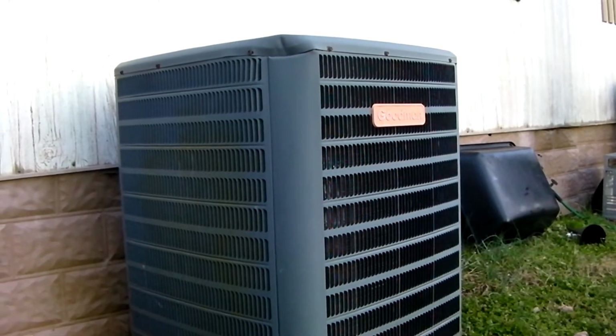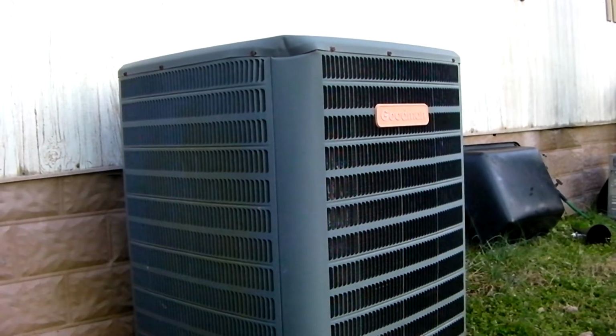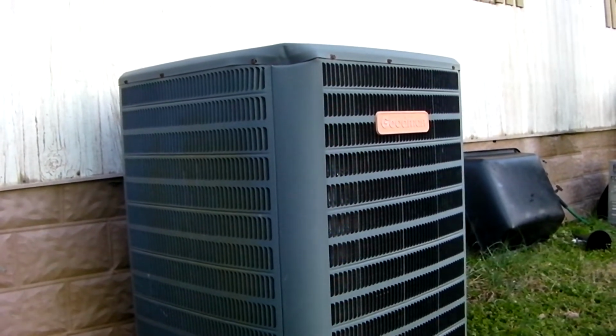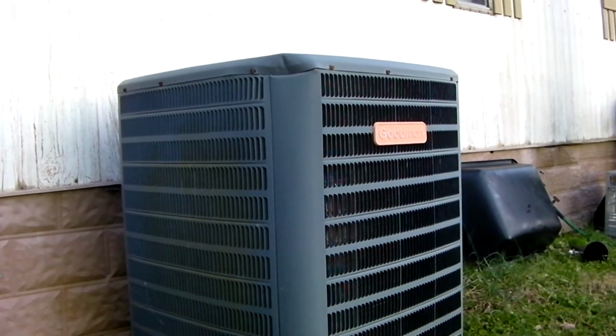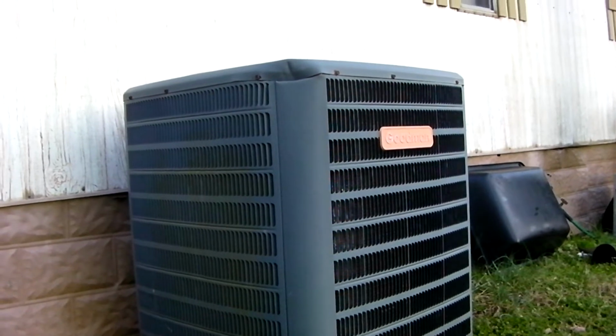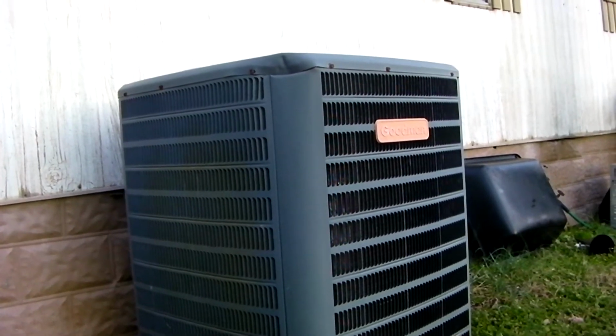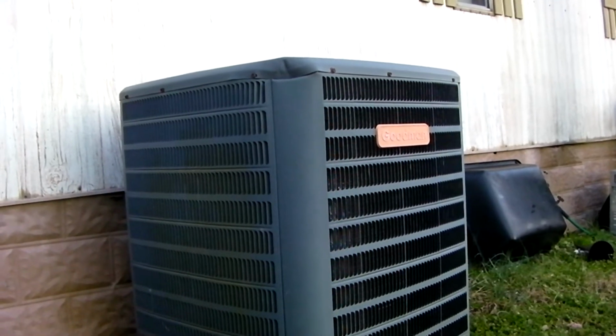So in November of 2017, I said I'm done with it, and went on eBay and ordered an Emerson Universal Heat Pump Defrost Control. It's a kind of one-size-fits-all electronic defrost control that features not only time temperature defrosting but also demand defrosting. Now this is where things make more sense.